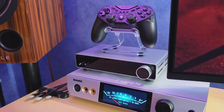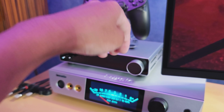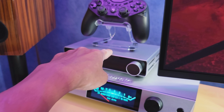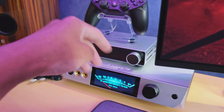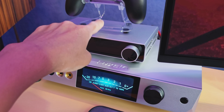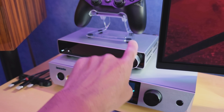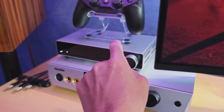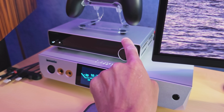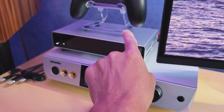So to combat that, I did a lot of diagnostics and testing to see where that noise was coming from, unplugged things at the back and so on. So I isolated in the first instance that it was the PA7, not the X9 or not anything else, not the PC, USB noise coming through or whatever. Nope, it was the PA7. I then adjusted the volume in bypass mode, because I was in bypass mode at the time, to maximum, minimum, nothing there. So it wasn't the volume attenuation somehow interfering with the bypass mode, so that's fine.